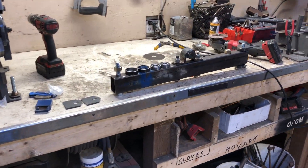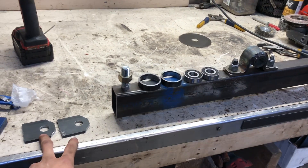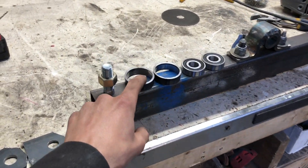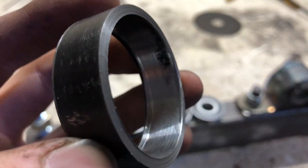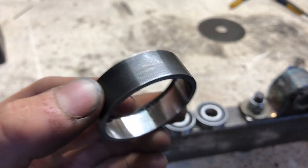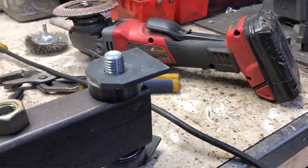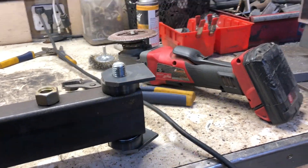We spent the morning doing some lathing, some cutting, some drilling, and here's what we're left with. We got the two C knuckle arms or tabs, which are these two top pieces, and then I just finished lathing up these pieces which go over the bearings. If you see inside, I did some internal lathing on those so the bearing gets pressed in there just snug, and then I'll weld this piece on top like that. Then I'm gonna have my back plate on the back side, goes down like you guys seen.